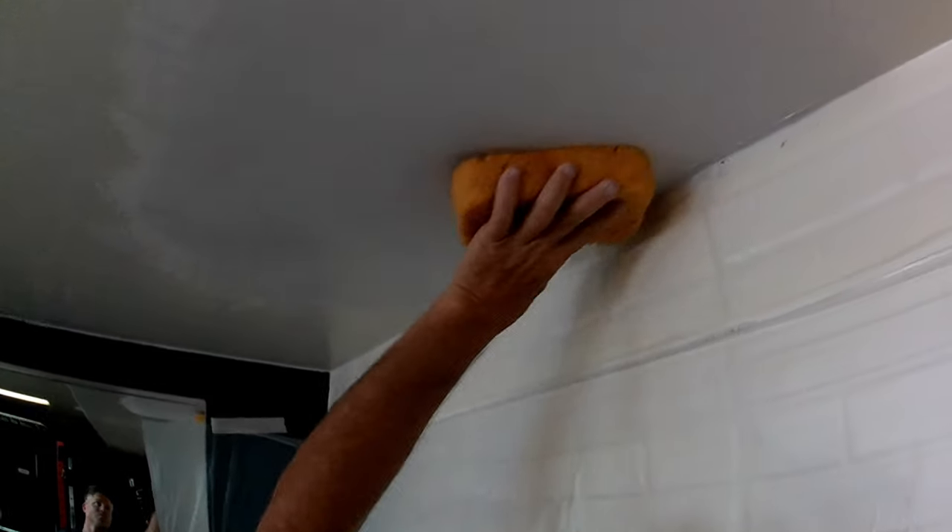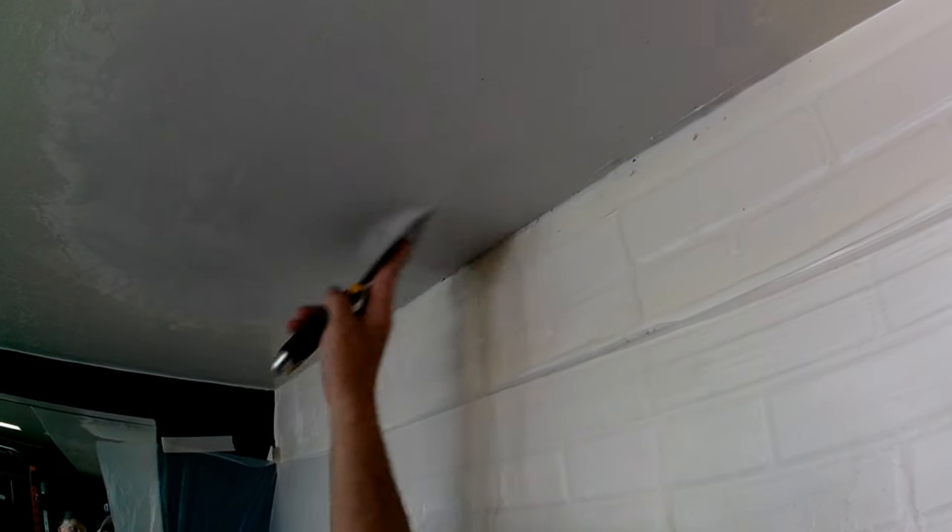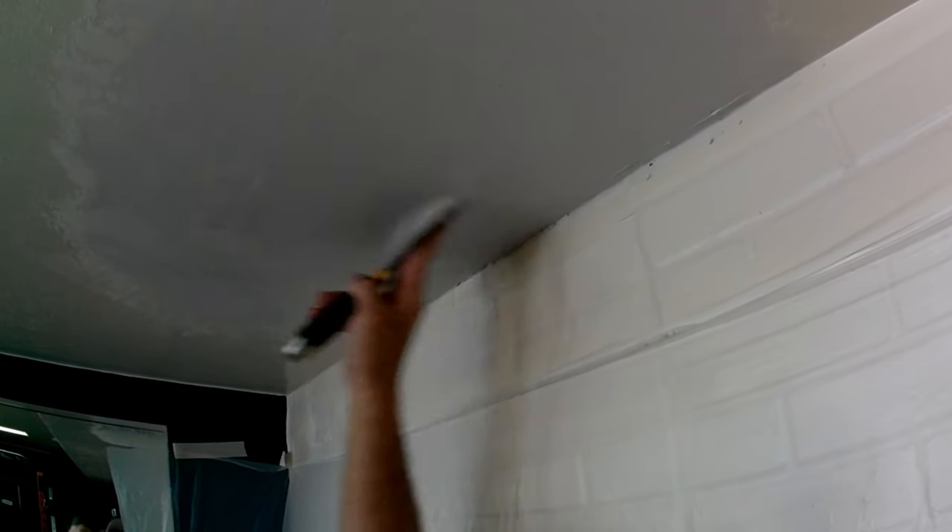Patching needs to be smooth, level, sanded or slicked out, and ready for texture. Texture is just a cosmetic finish. Depending on where you are, you might have a smooth texture. Out here I have a lot of different textures — this is a skip trowel style texture. If you have a smooth texture, you'd just finish with a tight skim coat of all-purpose joint compound, then sand it before primer and paint. This patch is about two by two — there's still some work involved: getting it cut back, sheet rocked, taped, coated twice, then textured with all-purpose joint compound skip trowel.